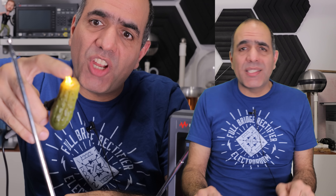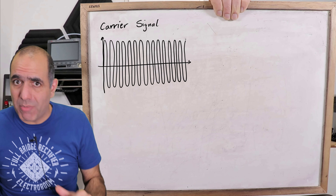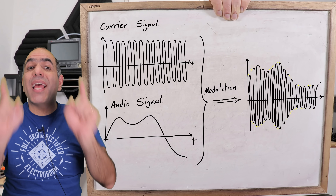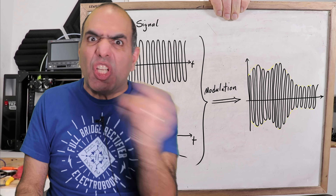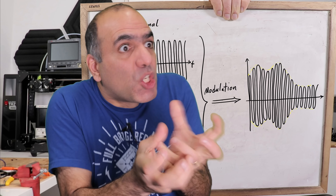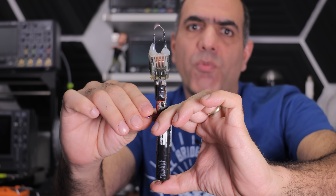That's why we must never touch AM radio towers. Not only is their power much more than this and can burn you to a crisp, but it is also a powerful carrier signal — 70 kilohertz in my case — modulated at audible frequency. So it has powerful low-frequency components that can shock the life out of you, and you won't be able to let go of the antenna while cooking to perfection.